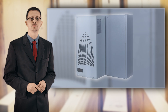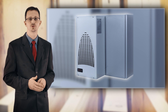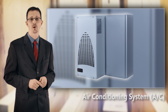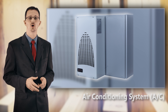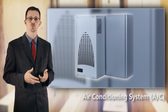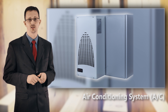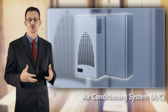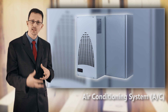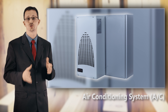There are also some smaller but very important features required for a good long-term CNC machine purchase. We need a cooling system for the electrical components — just like a home computer needs a fan. In most workshops, dust in the air is not good for electrical components. For that reason, the HO8 has a sealed electrical cabinet with an air conditioning unit installed on it to clean and cool the air inside, keeping the electrical system stable and secure.